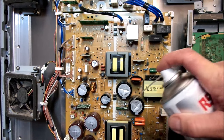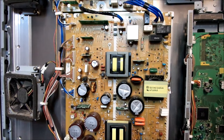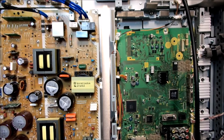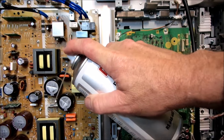We'll just give it a little bit of time to penetrate through the housing there, to get into the layers of the IC. And we turn it on, have a look at the flashing green light, and if it works it should go solid eventually. There we go - we've got our TV working, AV1 showing. And now we know that our fault is within our little IC just here.